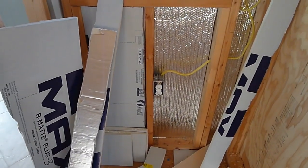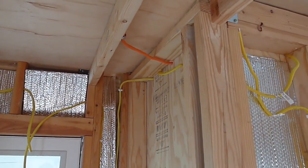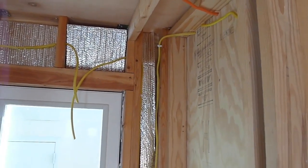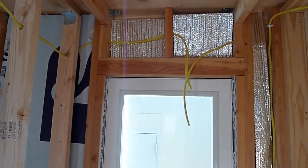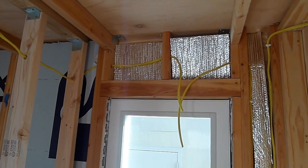This is the wire running in. The orange wire is 10-gauge wire and that's for the air conditioning unit so it gets all the amps it needs while having clean power. This will be the recirculating vent for the oven and stove.